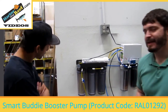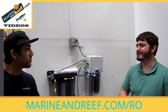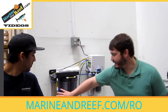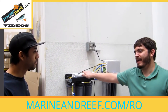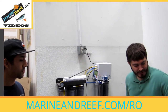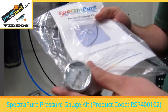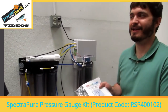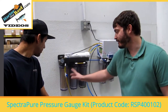Another reason to look at the pressure gauge — when you buy a new RO system, the pressure gauge will read some good number, assuming you have proper water pressure, say 60 psi. Well, when you come back to it, you're going to notice it's going to slowly go down in pressure. What's happening is as the sediment filter and carbon filters build up with gunk, less pressure is reaching your RO membrane. That's a sign you need to swap out those filters. If you notice that gauge goes down, the first reaction is swap out your pre-filters. If your unit doesn't have a pressure gauge, you can always add one with this SpectraPure kit. Some of the higher end RO systems include the pressure gauge, so it's something you can add.